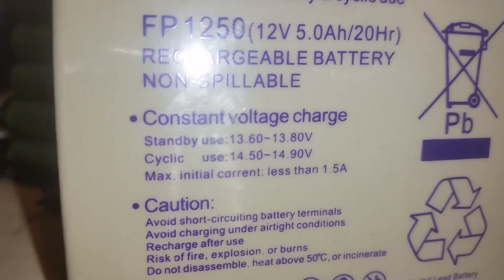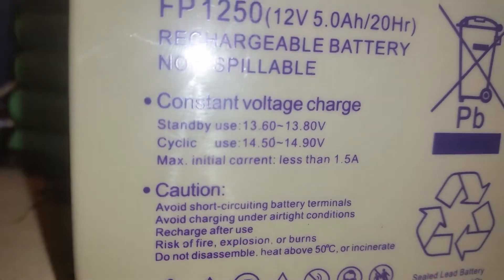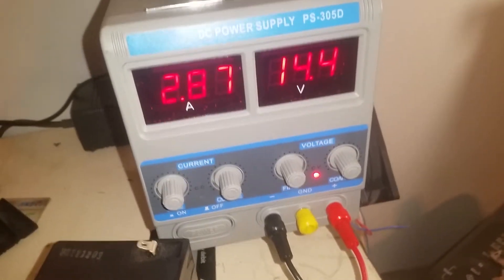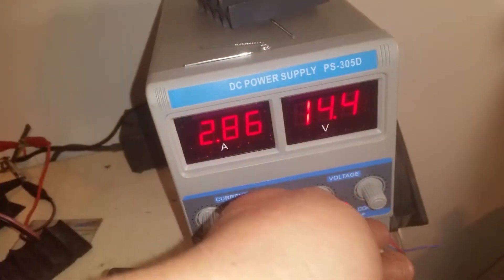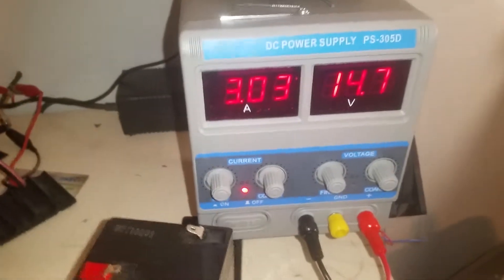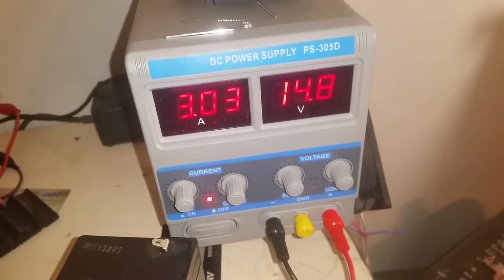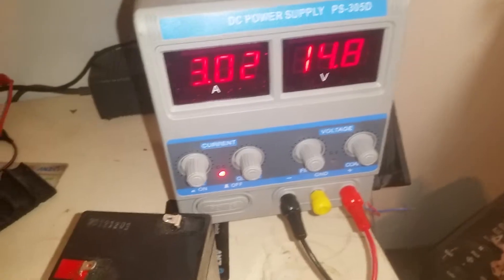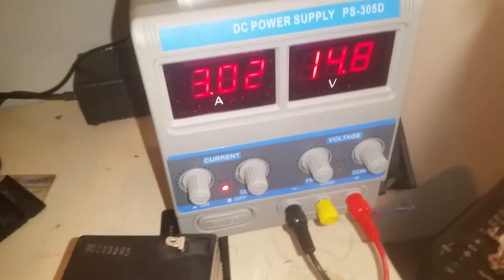I haven't really been able to work out how old they are, but that doesn't really matter. As soon as this red light is on, the power supply is limiting the output voltage. I'll go to 14.7V — halfway between, I guess — actually I'll just go up to 14.8V. We'll put just 3A into it for a while; 3A isn't much, it's like 700mA each.